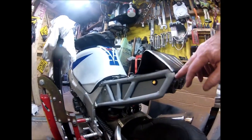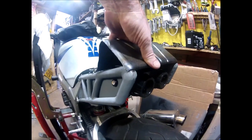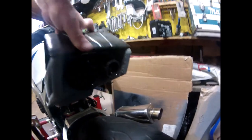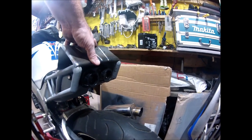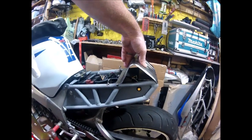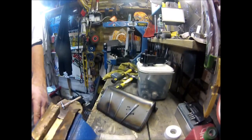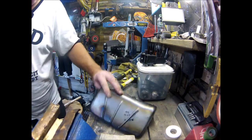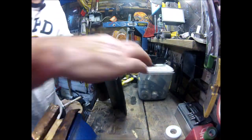This front corner here wants a bit of a chop — probably a pork chop. Let's cut a bit of that off and then wang some more round. Right, wanging and banging, see if that gives it a bit more balance. I've been using the most rounded profiled wheel on my English wheel — it's quite good for following this top edge here.